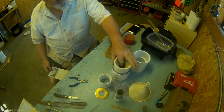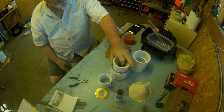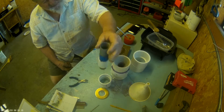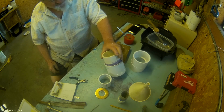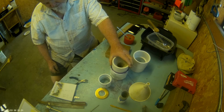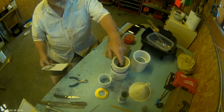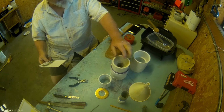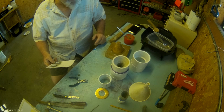I usually trim this diameter to 1.4 inches, the diameter of the nozzle washer. And right now it's 1.3, which is the diameter of the 1-inch PVC. The reason for not doing this anymore is that the Rockite will erode in just a fraction of a second. The pressure from a 1.3 diameter to the 1.4 is 307 with the 1.4 and 379 with the 1.3. So that's not too much of an increase in pressure, so I figure it can handle it.